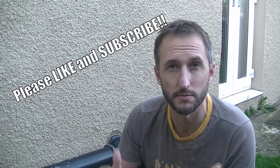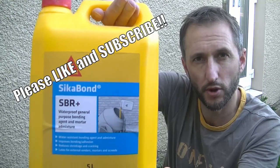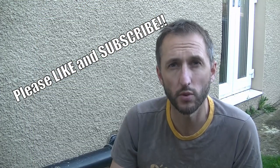According to what surface I'm rendering onto, sometimes I like to add a product called SBR to my mix, and I sometimes brush this onto the wall before I start rendering — this is the product I like to use here. But that's a discussion for another video, and for the purpose of this video we're going to stick to a basic cement, sand, and lime render.